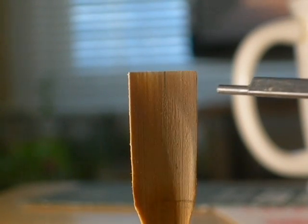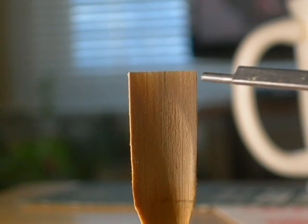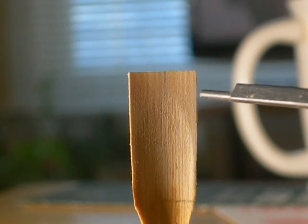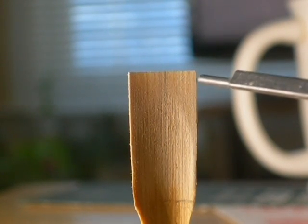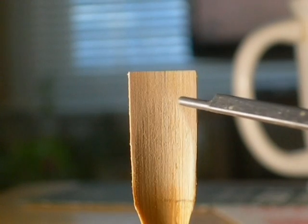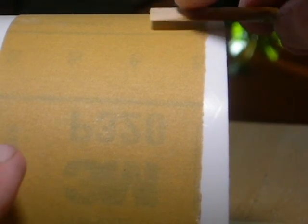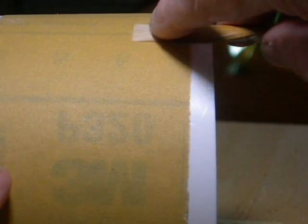At the other edge it's very hard to see, but it's good from the center all the way near to the edge — there's just the tiniest little reverse curvature at the edge left, and quite a bit down here that we'll address later. So I'm going to work mostly on this left edge and try to restore just a little more curve. Since I had almost perfected the upper interior curve using the sideways sanding method, I'm finishing up now with the in-and-out method — flat on the cylinder, very low pressure — and then we'll move on to the other cylinders to go deeper into the interior.